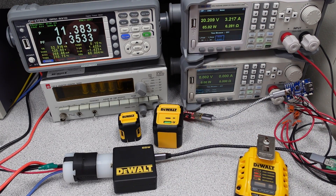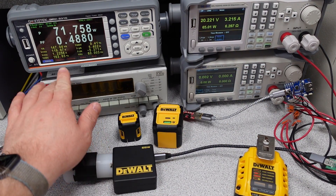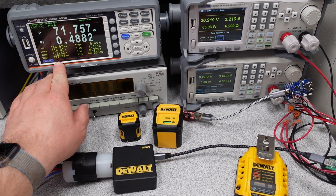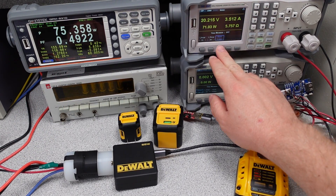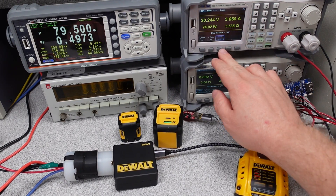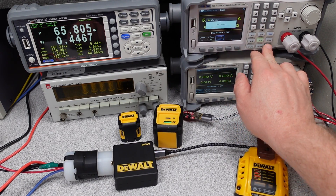Once we take these up to full power operating mode, it seems fairly standard — the DC voltage is stable, and they each deliver the claimed rated power no problem. For overload testing, the 65 watt power adapter shuts off at 76 watts and recovers after removal of the load — not bad. The other devices tripped at 14 watts and 57 watts for the 12.5 and 49.5 watt devices respectively. The 49.5 watt has independent outputs. If you watch the channel a lot, you know what's coming: power factor correction.